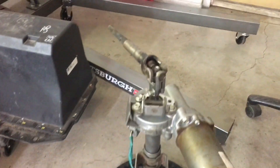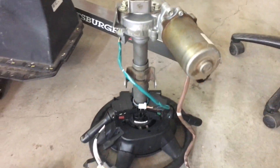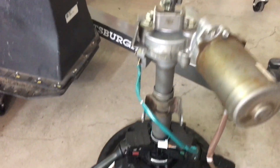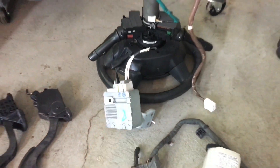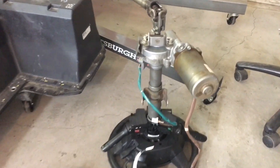Also, I got a Prius power steering unit here. If you pull one of these at a salvage yard it's really easy to find, but remember to get this control box — I had to go back for it. These wires connect to it under the dash. We'll have some videos on how to set that up and use this power steering.